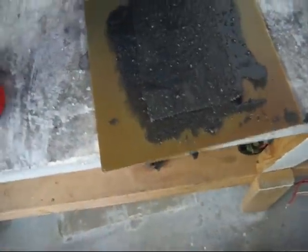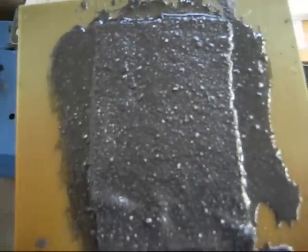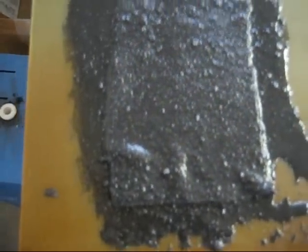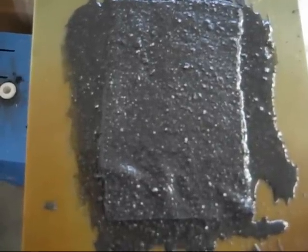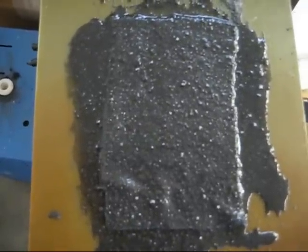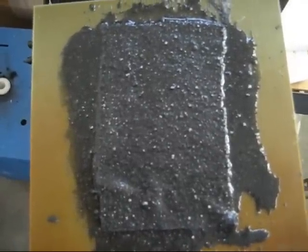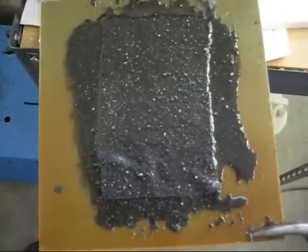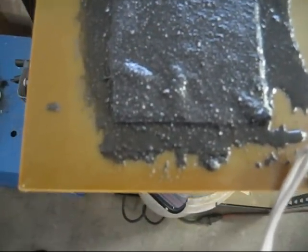Now that I've got it painted, you can do this with any material that you can mix up into a paste — it'll all pretty much work the same. You just have to figure out the depolarizer for the material you want to use. You could take apart an old carbon-zinc D battery, take the manganese dioxide out, wash it thoroughly, and dry it out in the sun. Then you could use that powder if you're doing a carbon or zinc cell, or a carbon-magnesium cell. It's very important that you find the depolarizer to remove the hydrogen from the positive pole.